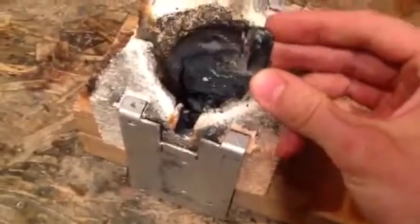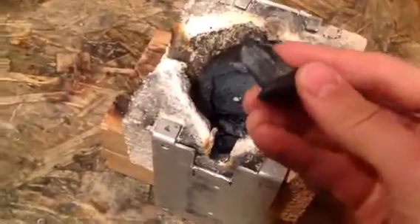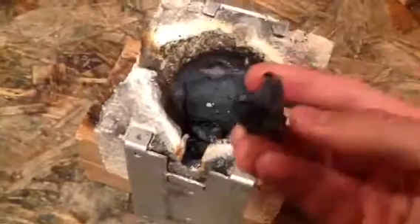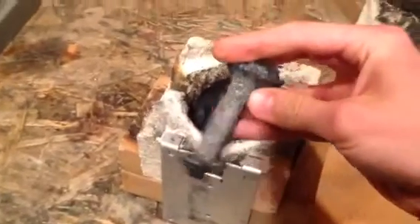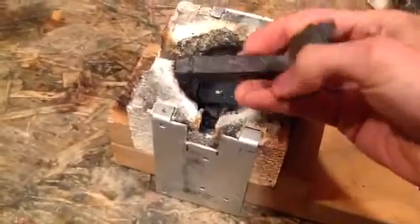It kind of went like this in the sand. The right angles aren't extremely sharp, and it really didn't go far at all into the gate, so that's kind of why it failed. The second time, this is the result — it's got a great surface finish on that sprue, some really nice right angles, just really smooth. It's awesome.